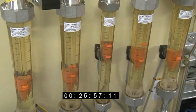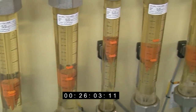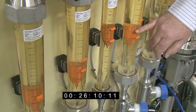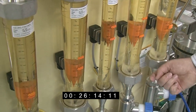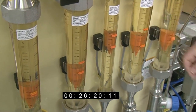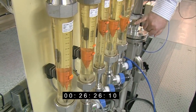These flow panels are quite useful because they give you a visual indication of whether you've got flow or not during times you can get in here — handy for commissioning. These orange floats have very specific weights, and the water flows from bottom to top through a tube with a slowly increasing diameter, so the height at which the float sits gives you an indication of the flow rate.